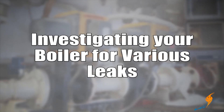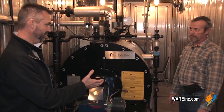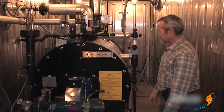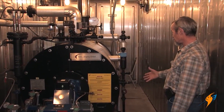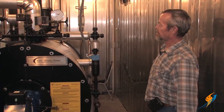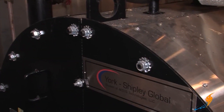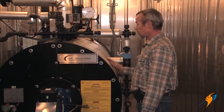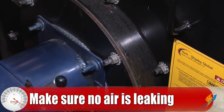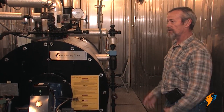I've been in a lot of boiler rooms and there are leaks all over the place — whether it's a water leak, a steam leak, and we definitely don't want gas leaks. As we talked about with the gauge glass, that's a very good place for leaks on the gauge glass and gauge cocks. But you can have any valve — especially the packings — apt to have leaks. They need regular maintenance on tightening that packing up or repacking the valves. You can also have flue gas leaks from around the doors. Run your hand near the door — don't touch it because it's hot if the boiler is running — and make sure there's not any air blowing out around the burner. You can see the gasket material; it gets old and eventually is going to have a leak someplace.